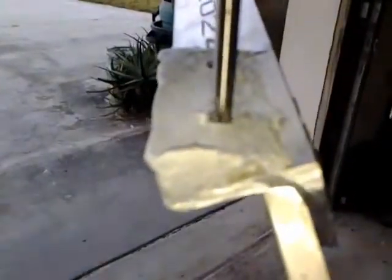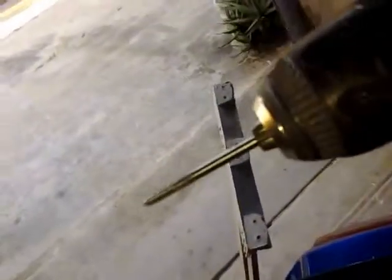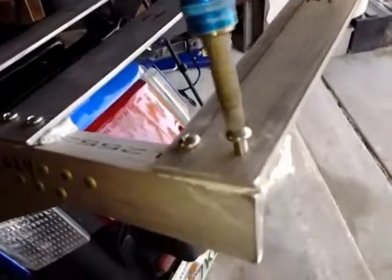Because I'm careful, I can use my drill to simplify the tapping process. Now, with all the holes tapped, an 8/32 bolt should screw right in. If so, then I can go ahead and screw down all the top plates.